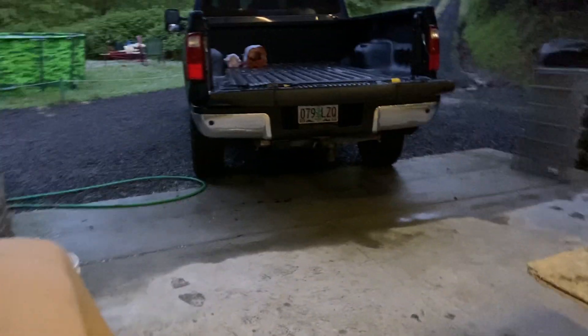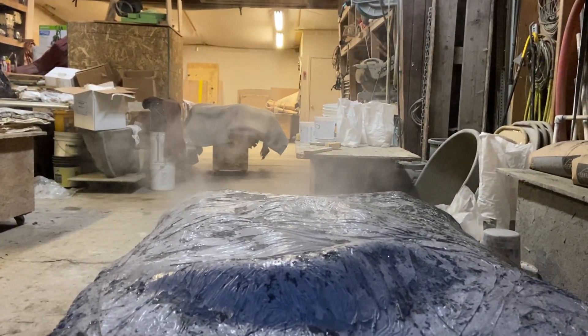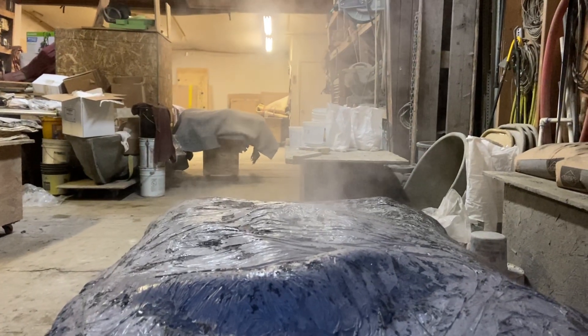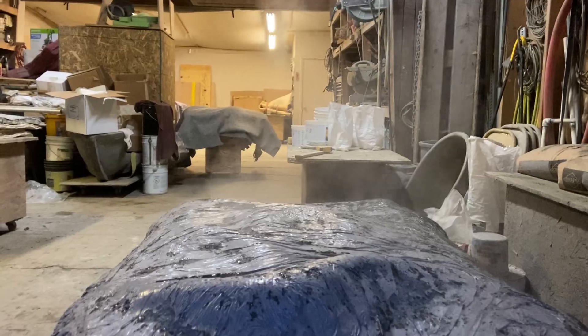I included this video because I thought it was cool — after I got off work, I came home and cast six panels, covered them with plastic and then four or five sleeping bags each, and now I'm breaking them open and you can see the heat I've trapped and cooked these panels with. You can't put your hand on the panel for very long, it's that hot, and you can see the steam coming off. Now I'm taking them to the job to use them this morning.